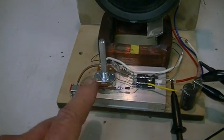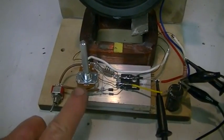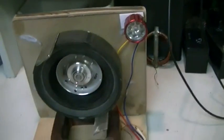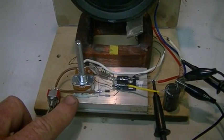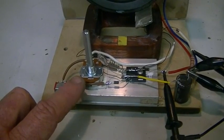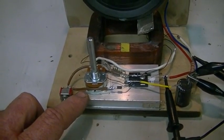When we throw the switch and go into pure self-oscillating mode, we can use the full sweep of our 25k pot to adjust the frequency and the brightness of the LEDs. Somewhere in self-oscillation I can go from around 200–300 Hz up to about 1.2 kHz.